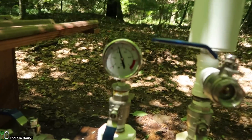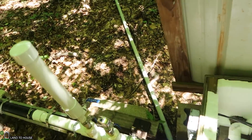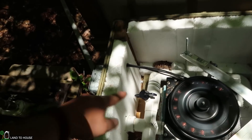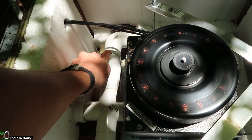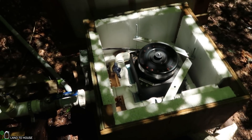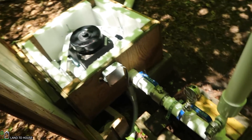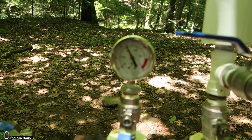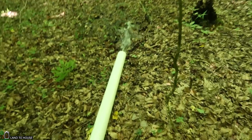Back down here at the turbine, the pressure is holding at 65 psi, which is really good. I'm not sure if we have enough water to run two nozzles, but we're going to give it a try. We'll know if that starts to drop the psi that we're out of water. I'm going to go ahead and turn on another nozzle here. That one and that one are still turned off, and that one and that one are on. Let's see if we can maintain that amount of water flow. We are running at 60 psi right now. We'll see if that maintains or if we don't have enough water to run both of those. I'll show you the amount of water that's coming out of this pipe here.